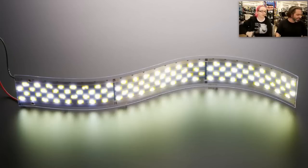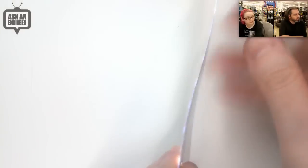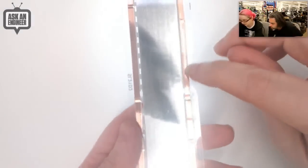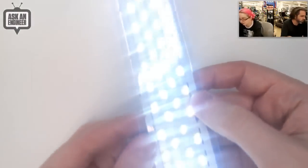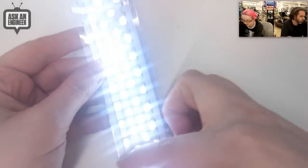It is fully printed — it's printed onto this laminate. We got this one, it has a checkerboard pattern. And you can move it around — so it's super skinny, which is one really nice thing. It's thinner than almost anything else because it's basically laminated plastic. You can see the copper tape — that's your positive and negative. Here I just have it connected to power and ground. You can give it 12 volts. You can cut it. This has three pieces — each section is one piece with a little gap, and you can cut these pieces.